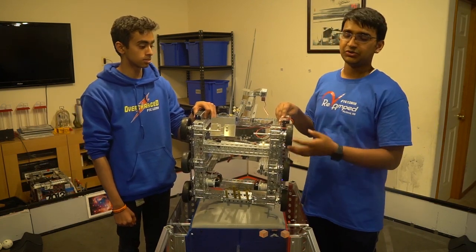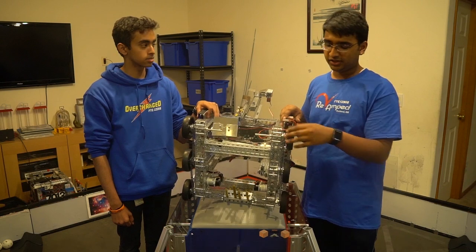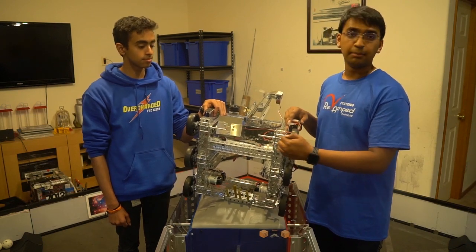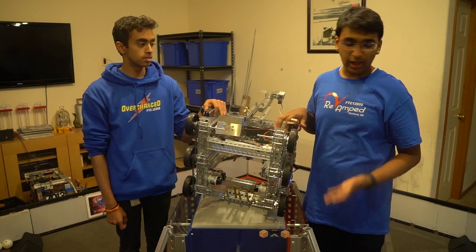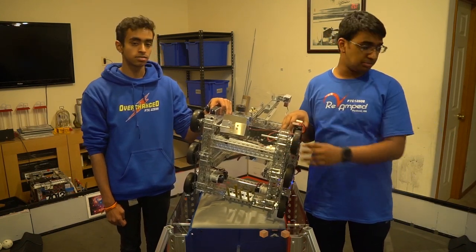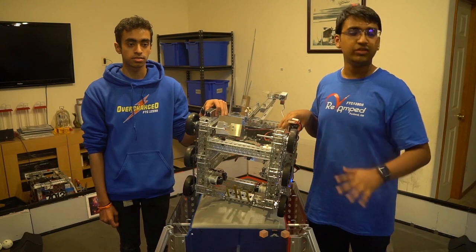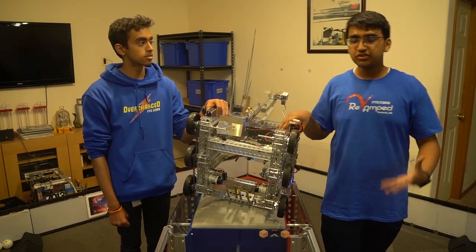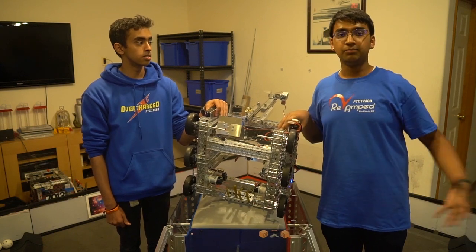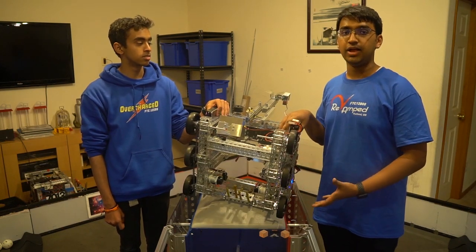There were also questions about how far the bottom of the wheels is from the bottom of the chassis. Because we went entirely off Actobotics parts, this was actually only a one-inch gap. Another question was how effective we were at getting into the crater zone and collecting debris. This drivetrain is fully capable of getting into the crater zone by itself — we've tried it forwards, backwards, fast, slow, all combinations, and all were successful. Unfortunately, when there is a lot of debris, the drivetrain has a huge struggle getting beached on debris and can't get grip after entering the crater, resulting in us getting stuck in quite a few attempts. So if you go with a stock Actobotics chassis, please be careful and be prepared to do your own modifications.